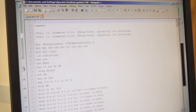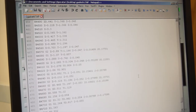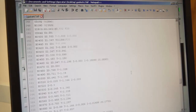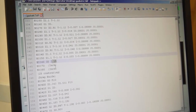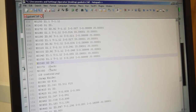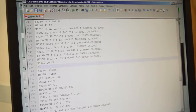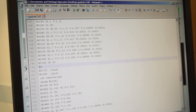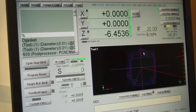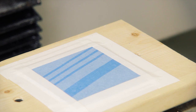I'm going to change the G-code — I clicked on the button 'change G-code' and I'm going to go all the way down to the bottom, which is where the outer perimeter starts. I'll find the start of it, which should be right about here. Where it says Z.15 at the end of the other contour, I'm going to change that to Z6 so that the drag knife cutter moves up six inches. Now I'm going to add a line that is M1 — M1 is an optional stop — so the cutter will stay in that position until I hit cycle start, then it'll come back down and cut the outer perimeter. I'm going to save that and close it. Now we're ready to go ahead and cut, using a 60-degree blade.